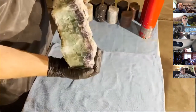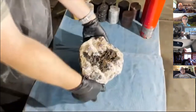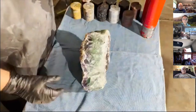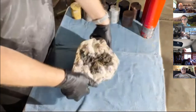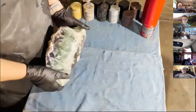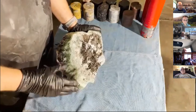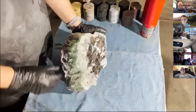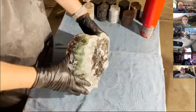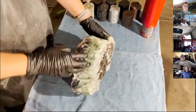So this one's pretty obvious which way we're going to lay it. It's going to sit like that, or it's going to sit like that. Coring it like this just isn't going to be very stable at all and won't make much sense. So let's sit it like this. It's reasonably stable. We might get the angle grinder out, use the Highland Park wet grinder with the diamond wheel on it. We might just take a couple of these off. The other way to do it is to plaster of Paris it. I have tried wedges in the past. This bit's probably suitable for a wedge, but I'd rather do plaster of Paris, or I like to keep them cut with a flat face.